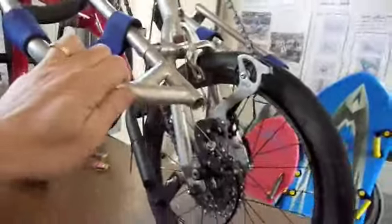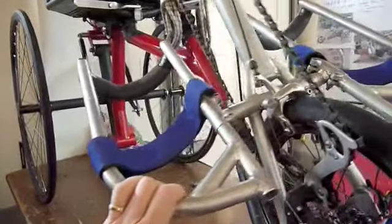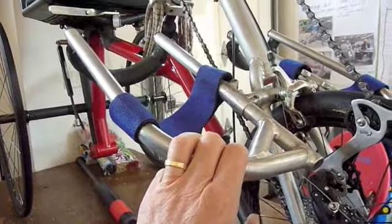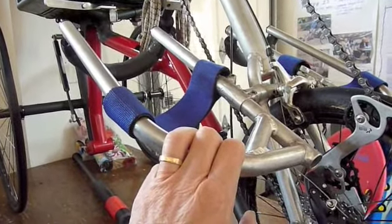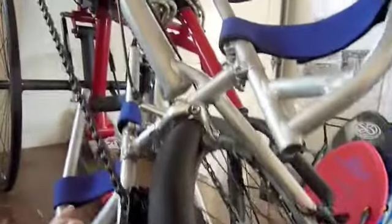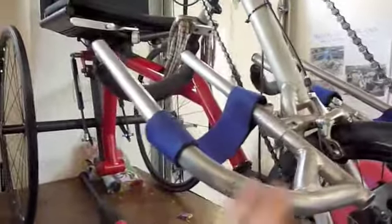Now, one thing to notice, you see the bike starting to go up. You can see as you turn a little bit, it's not moving up, which indicates sort of a neutral trail issue. And then as you start going up, as the patch is moving away, now the frame is starting to rise, which makes sense. It's going to want to come back.